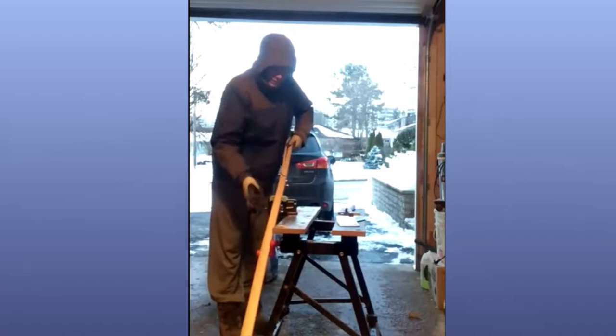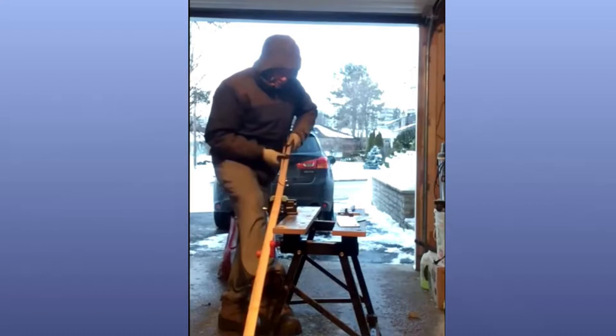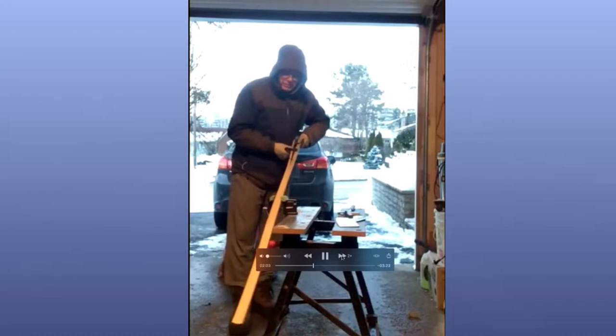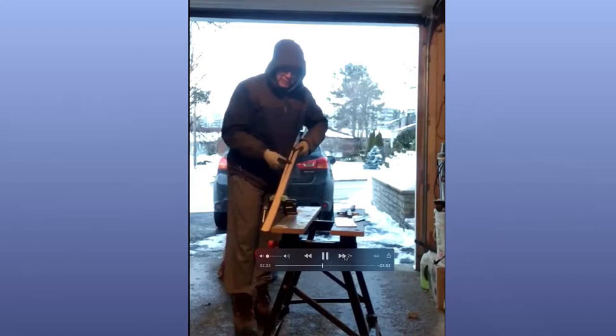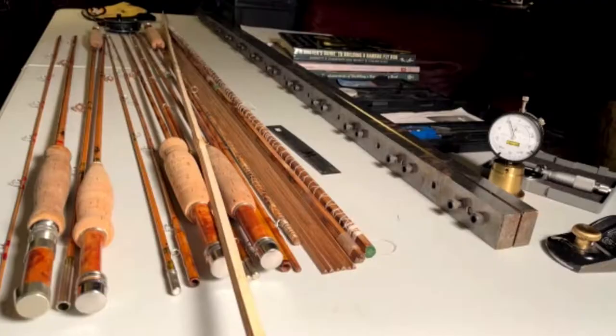You move it down and grip it at the nodes — it basically tears clean down to the node, then you run into an issue. That's where you want the clamping pressure so it doesn't tear off to the side. It's an acquired technique — after the second or third culm I split, I figured out how to do it. That's how you get the strips. By the way, I never touch bamboo with bare hands because you'll get unbelievable cuts and splinters — the stuff is incredibly strong.